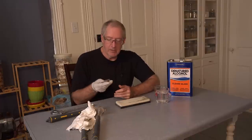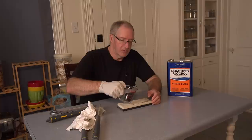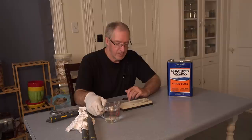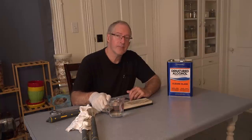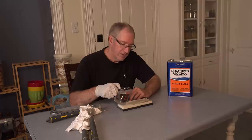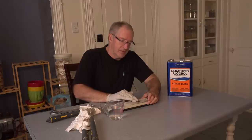Now that it's completely clean and dry, I have here a sharpening stone I picked up from a local woodworking store. I'm going to put a little bit of water on there and it should absorb that water. See how it just soaks right in - like magic. I think this stone came from Arkansas or one of the southern states. I'll prime the stone up with some water - the bottom side of the blade is down against the stone, and I'll just rub it for a bit, keeping it wet.